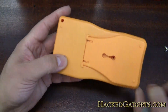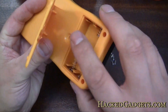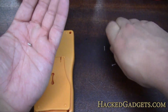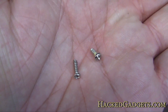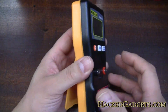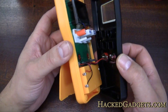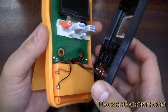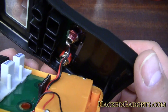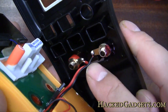Okay, let's crack this thing open. I've removed the four screws from the back and also taken out the battery compartment. They're self-tappers — no threaded inserts, which would have been nice. The only complaint is they could have used five of all the same screws, but the battery compartment one is a little bit different. Taking it apart — there are wires coming over to the front, soldered in place, with a bit of thread-lock to keep things in place.